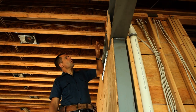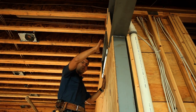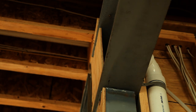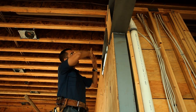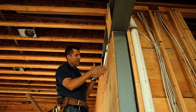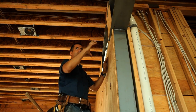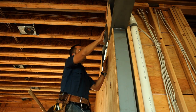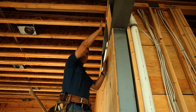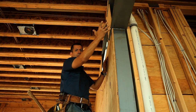So if this were just going to be a sheetrock plane straight all the way through, well, that's going to be a big problem because there's not enough hot mud in the world to take care of that. But upon inspecting the plans, you discover that actually this whole corner back to about here with the vent is going to be a built-up box column with a beam going across to cover the steel. So the fact that this veers out like this is really not a problem you need to address because it's all going to get covered up in the box column that gets built here.